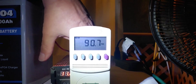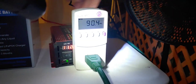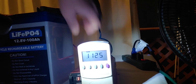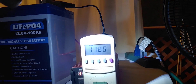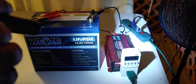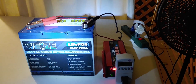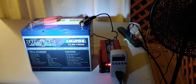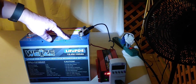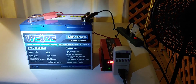All right folks, this has already passed our test. It is still right around 100 watts. The inverter says 11.2 volts and our kilowatt meter says it has been 11 hours and 25 minutes and it is still running. So considering the energy loss from this cheap little inverter, this has already passed its test and I'm going to let it keep running. I'll put it in the description how long it's really going to run. This battery, even for a Mini, is doing an excellent job — actually doing better than I thought it would. So if this is the size that's going to work for your system — if you're going to have it in an RV, trolling motor, or a boat — whatever you're going to do, if this size will work, then I'd say this is probably a pretty good buy.